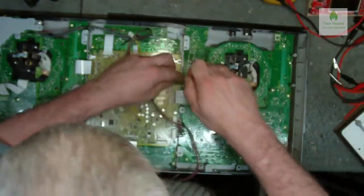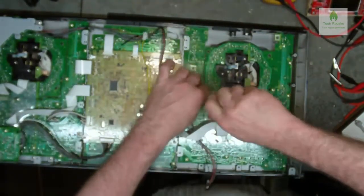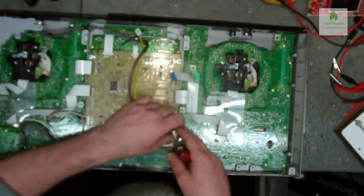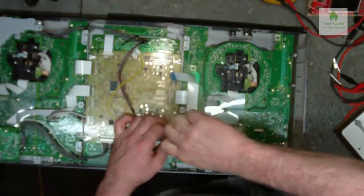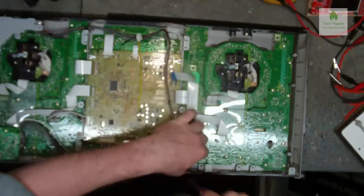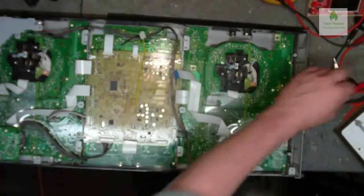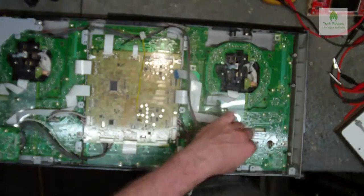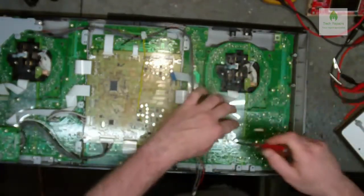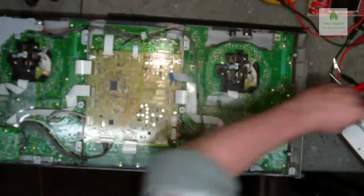And remember again, check your screw lengths as you're unscrewing them and taking them out, because if you have one that's longer, you want it to go back in that slot, not a different one. I've had it in the past, and I've known people in the past, and I'm going to admit that I've done it myself a couple of times. After a couple of times of messing something up and causing yourself a headache and a nightmare to sort out, you tend not to do it again. A couple of times I've put screws back in that have been too long, not thinking, just thrown it all back together, and I've screwed through and damaged a board underneath, or damaged a trace on a board or something like that, and it's a nightmare, seriously. So anyway, that story's for another day. Let's concentrate on this one at the minute and see where we're going with this.